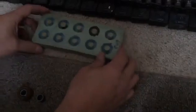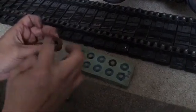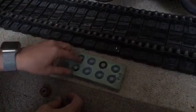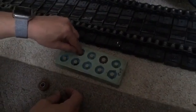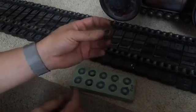All of these little tiny wheels were custom made. I bought a piece of rubber that fit around a bearing — this rubber was from McMaster-Carr, and it came in a tube. I sliced it and slipped the bearing in. Then I molded this, and what happens is you take each of these bearings and just slip them into the mold. You pour your two-part urethane in, and when it cures you pop them out. They become little wheels with a bearing embedded inside of them.